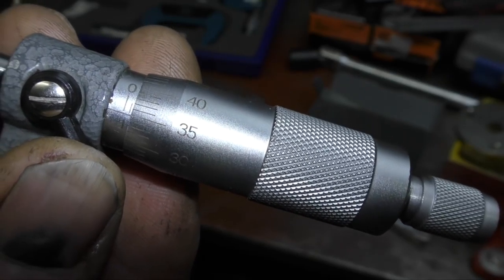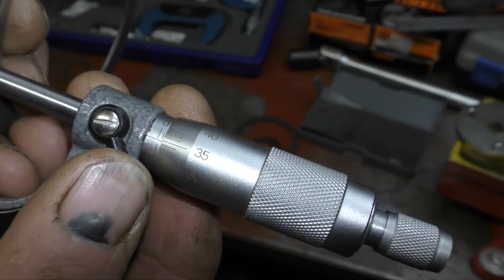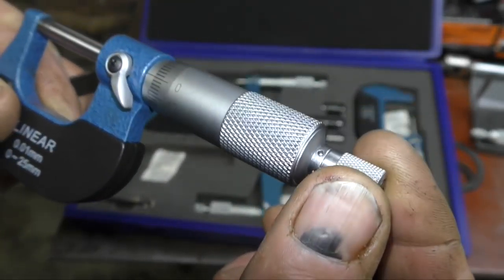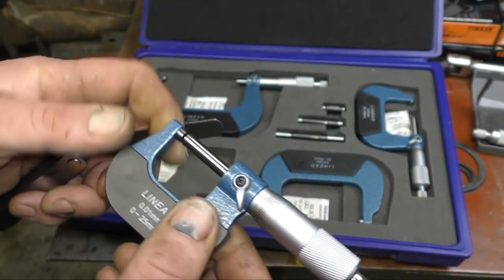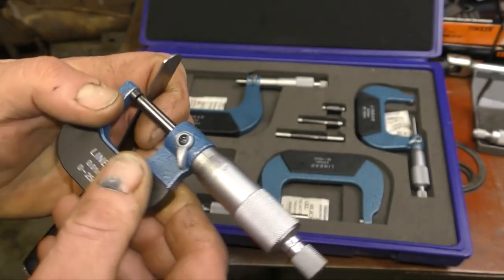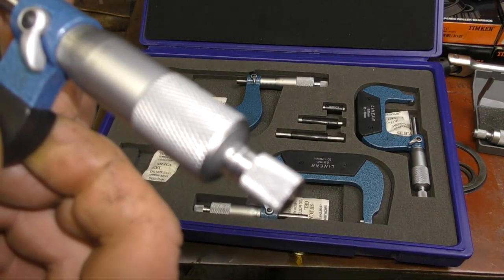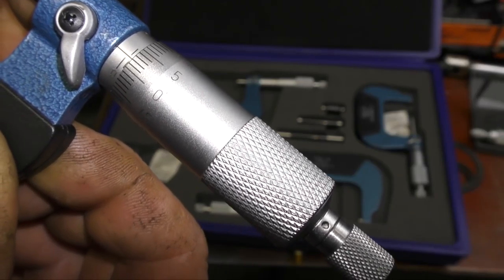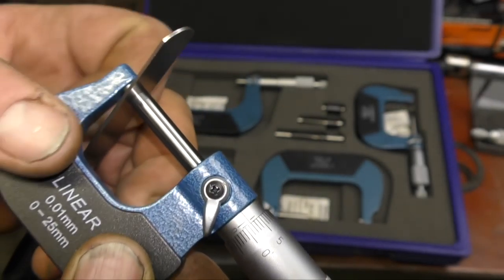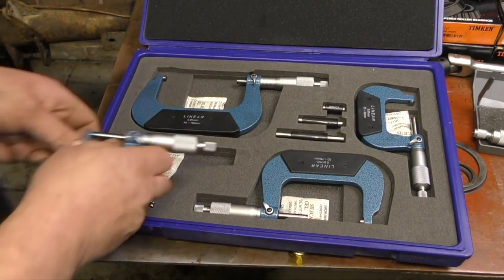This Screwfix one was checked by a calibration company and they basically said that it can't be calibrated - I would imagine they've tested it and it's had inaccuracies as the sizes got larger. Here's a tip - I've got some feeler gauges, and just for an example, a one millimetre feeler gauge - I'm going to measure this to see exactly where one mil is on the micrometer, because I've got some shims that are a mil out measuring them. You can see that's 1.02 of a mil - the feeler gauge isn't exactly accurate compared to the micrometer, but there you go. If you're new to micrometers, get some feeler gauges and just keep measuring so you get the feel of your micrometer.